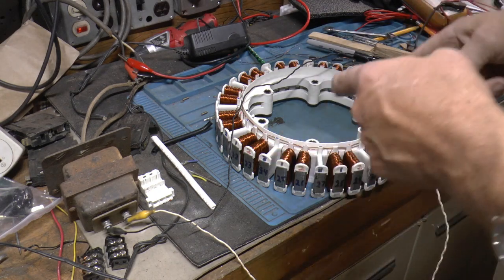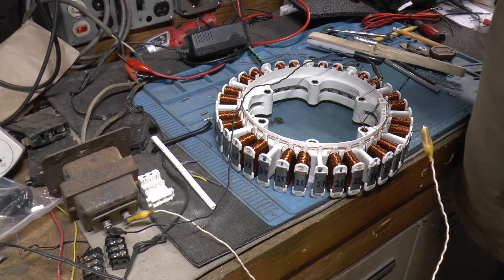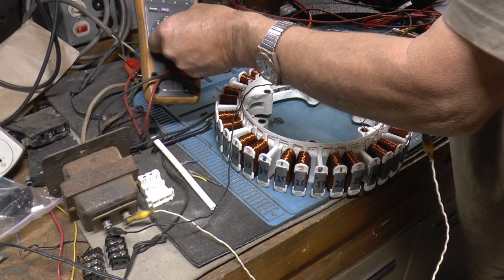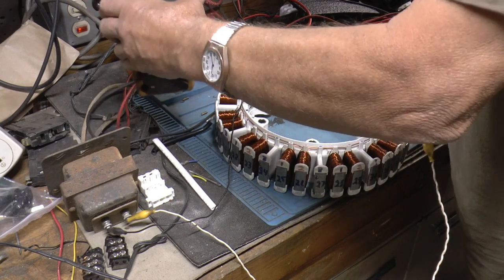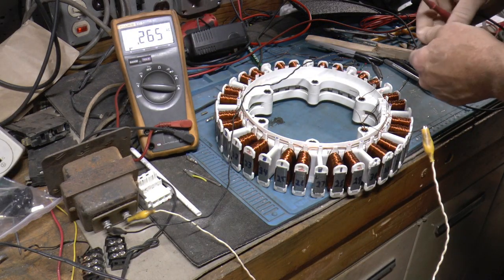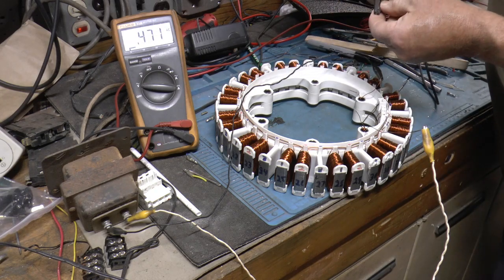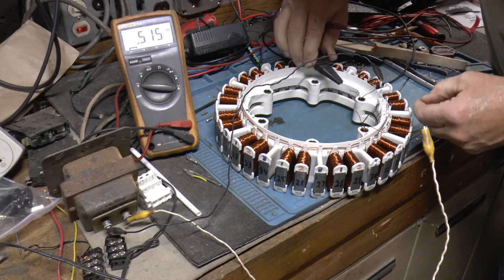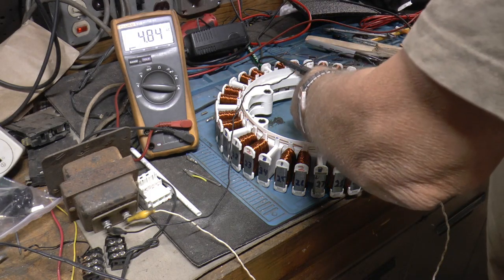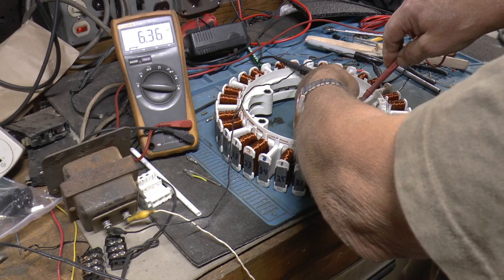And I was thinking, those other coils, I wonder if this will act like a transformer, because more or less that's what it is. I took a voltmeter onto the, let's see, AC volts. Well, it should be the same amount that we're putting in, I think, because it's 1 to 1. Now we got 6 volts AC.